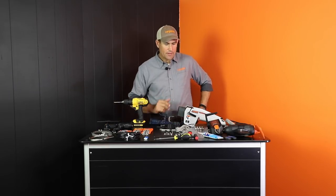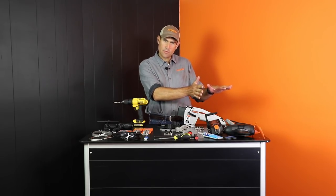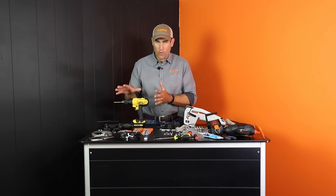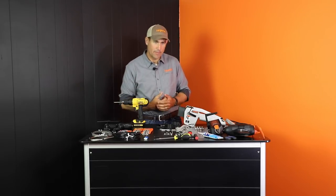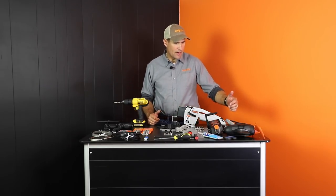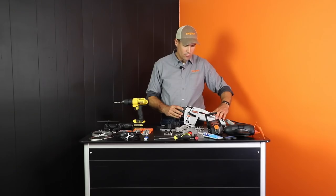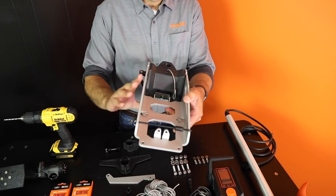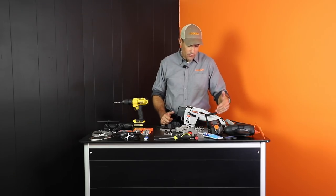So I have everything laid out here. On this side is everything that comes with the Torqeedo Ultralight 403 AC, and this side are the Bonafide and YakAttack parts that really augment this installation to make it super easy and super useful once you put it all together. We have the pylon. So this is the motor itself. This is the bracket, which goes right onto the four bolt pattern of the inserts on the stern of the SS127.